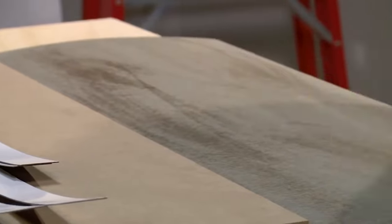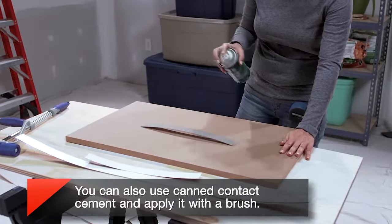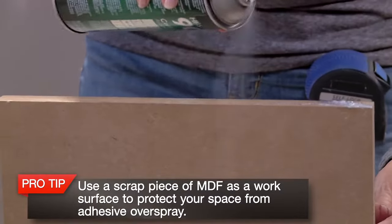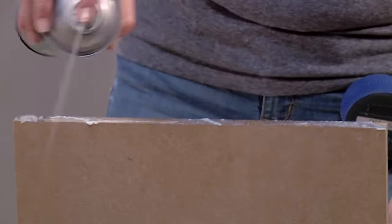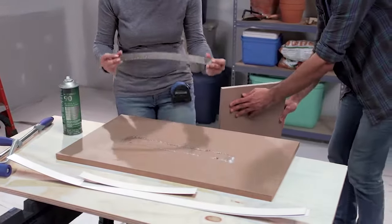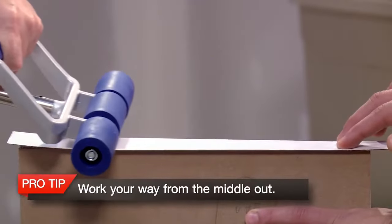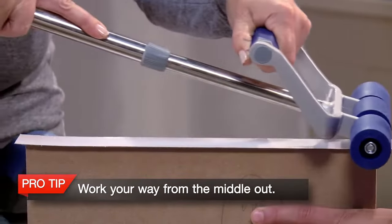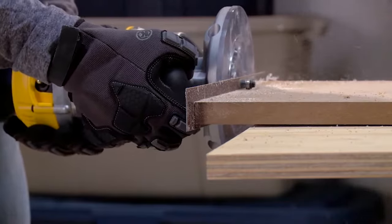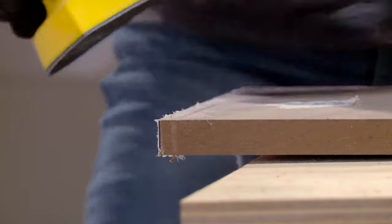Any dirt can show up as a bump when you glue the marker board to the MDF, so wipe all surfaces to remove any dust and let dry. Now we're ready to glue. Formica Group recommends using a contact spray adhesive because of its strength, ease of use, and cleanup. You'll start with the edges first. Spray the adhesive on the marker board strip, then spray two coats of adhesive on the MDF panel edges — we're spraying the edges twice because the raw side of the MDF panel absorbs more glue than the face. Let the adhesive get tacky. Be aware that once the two surfaces with the adhesive touch, they will permanently adhere, so make sure the strips are aligned before applying. Apply the edge strips by hand, making sure there's overhang on all sides. Use a J-roller to apply pressure to bond the edge to the MDF panel sides, rolling from the middle of the strip out to the edge. When you roll to the edge, be careful not to crack or break off the overhang. After the edge surface is covered, trim off the excess material from all sides with the router and flush trim bit. Use a sanding block to make sure the marker board is flush with the MDF. Repeat this process for all the edges of the MDF panel.